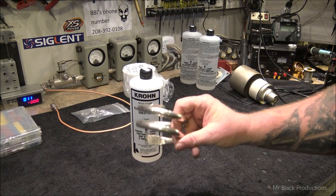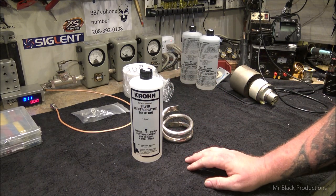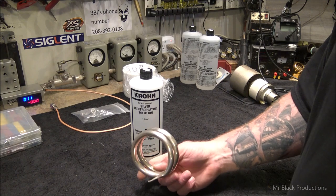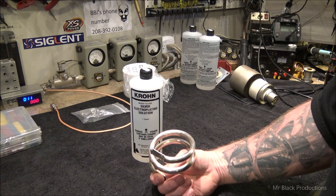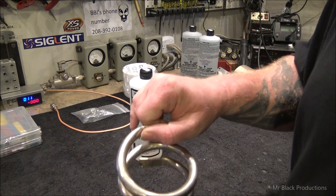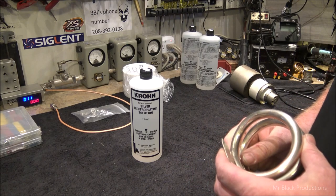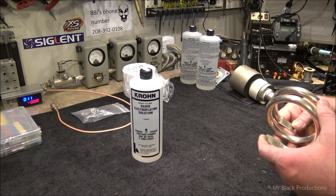Beautiful silver-plated components. Now, in theory, what you'd want to do is first etch this in a very light acid. Then we rinse that in distilled water. And this was one of the very first pieces I made 4 or 5 years ago, and as we can clearly see, it's not tarnished or degraded in any way. What I didn't know about, though, was sealing the ends of the coil, which we'll cover in a later segment.